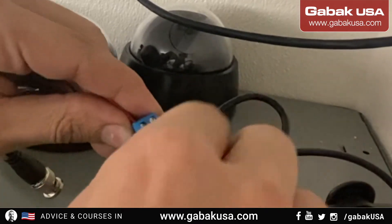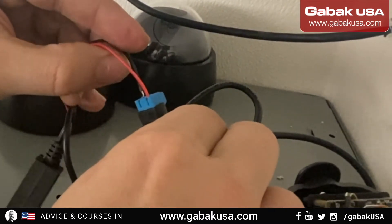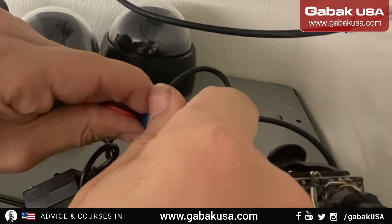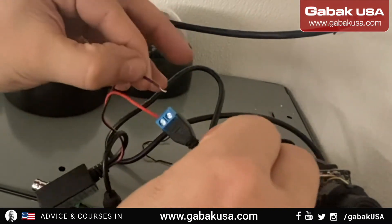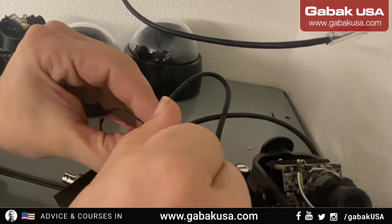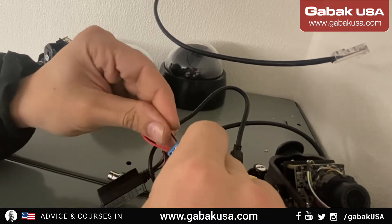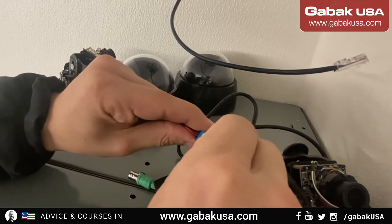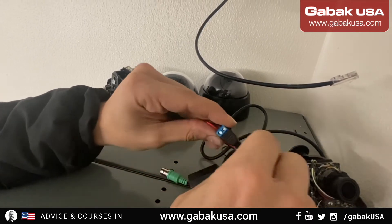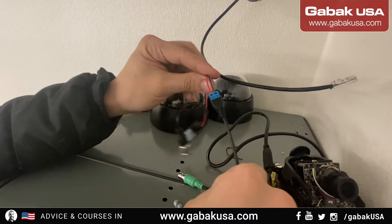Close it, then do the same with the other one and tighten the screw. You should be able to pull — if it comes loose like it did on this side, unscrew it and do it again. The thing is, if the wire doesn't have enough exposed conductor on the end, or if it's too little, it may come loose, or you may not tighten it all the way. Now I'm pulling here — as you can see, it's not pulling off. We can finish the installation.